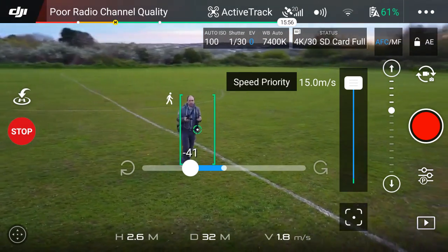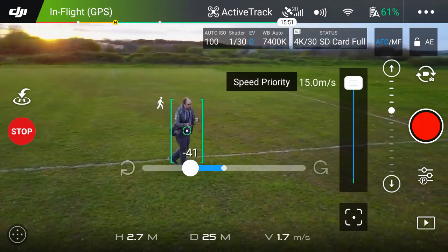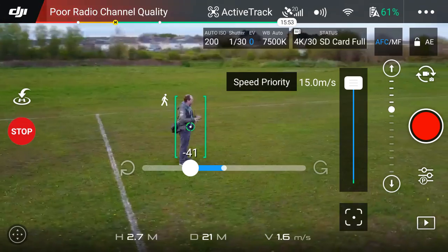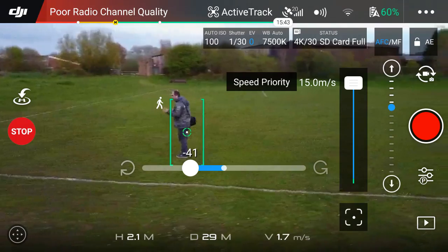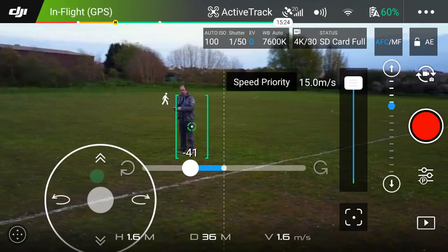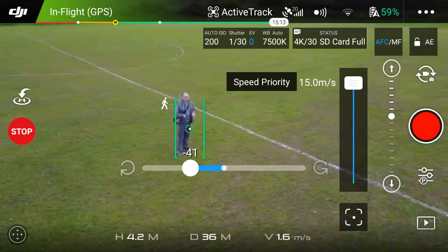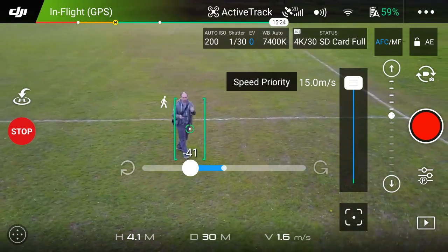That's it really for the Wi-Fi control mode. You have a couple of limitations: 80 meters horizontally from the takeoff point — it is not the location of the pilot, even if you are using a device with GPS. It's a shame it can't update the GPS position to the app. There is a limit of 50 meters in both ActiveTrack and TapFly when using those modes on the Wi-Fi option. Thank you for watching, I'll do another video again soon.